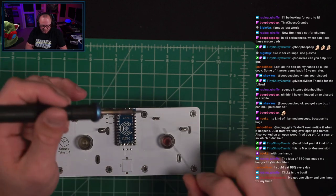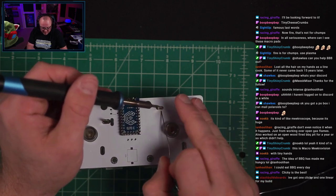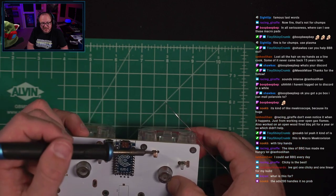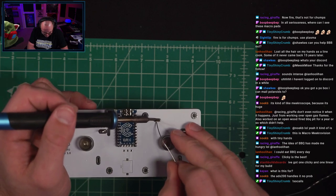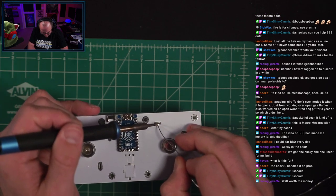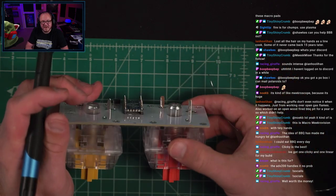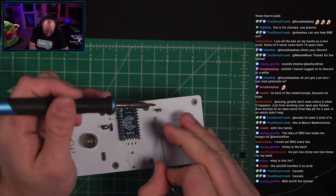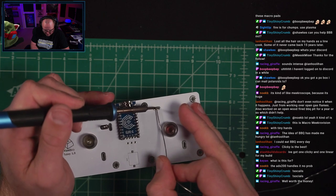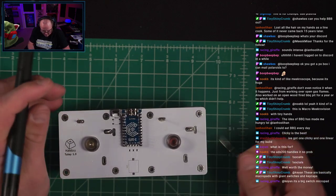That makes sense, kind of. So I just tacked the one down over there, and I'm gonna tack the one down over here because there's a huge amount of play. So this kind of shows you how you should be soldering normally, right? You should be heating the pad and the pin up at the same time. And that's kind of what we're doing over here. We can add a little bit here to make this a little bit faster. So what we did there, we got a little bit of tinning going on. You could have added a bunch of flux too. So we're gonna heat that whole deal up. Basically, we're heating this pin up. Right, oh, there it all flowed. That's fine.